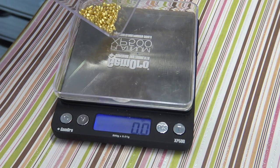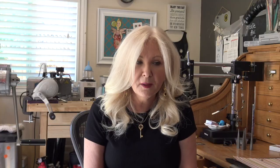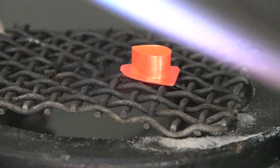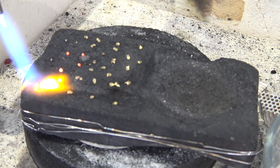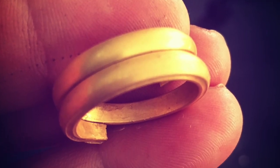I'm going to teach you how to alloy your gold. You're going to start with some 24-karat granules, and we're going to alloy it with a little bit of copper and silver — changing the alloy from 24 down to 22-karat — so that you can fuse it and it will be usable for bezels, backplates, granulation, pendants, and earrings. I'll even show you how to take that alloy down a little bit further into a 21 or 20K, so you can make ring shanks to go with those beautiful bezels and backplates.